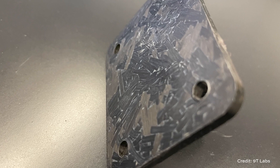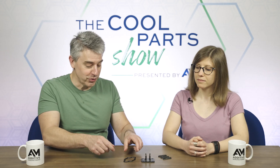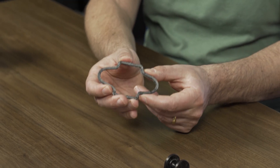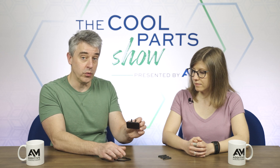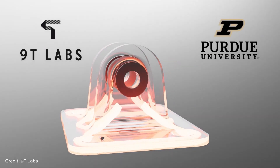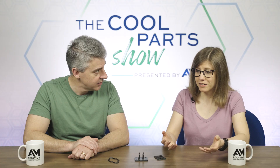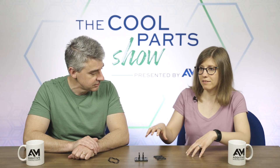You can see what it looks like in the finished part here. Everything gets compression molded together. So this is a 3D printed bracket even though 3D printing is just for the continuous carbon fiber preform material. The rest of the bracket form is filled with chopped fiber platelet, and then during the compression molding step this part and the base fuse against the reinforcement to make the complete bracket. So even though part of this bracket is 3D printed and part of it is molded, it's all composite — you've got both the continuous fiber composite and the chopped reinforcement.